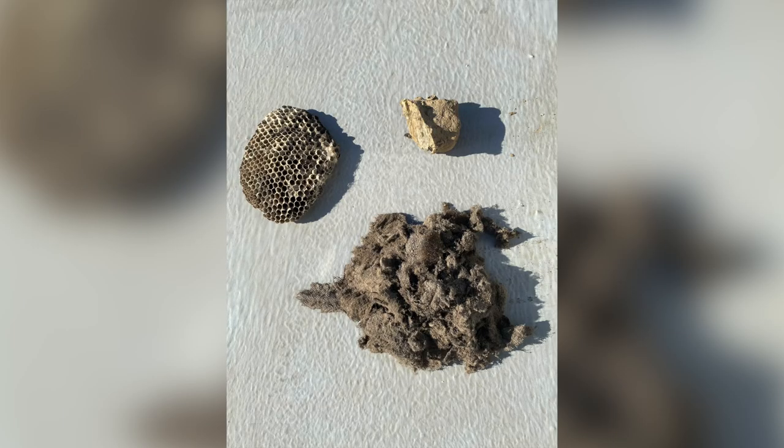To recap, when I lifted the white plastic cover I found a big ball of dust I was able to scrape off, plus a beehive and another type of nest in there as well. After cleaning everything up and putting it all back together, I came inside and flipped the AC back on. Right away the suction sounded a lot louder, and when I put my hand up to the vents it was blowing as hard as before — if not even better.